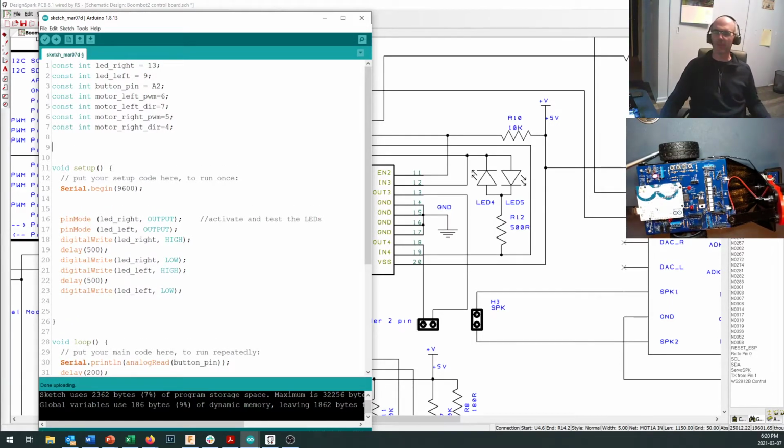Okay, so PWM, as you'll recall, is pulse width modulation, and pulse width modulation is what we use to lighten and dim LEDs, and it lets us turn the pin on for a fraction of a duty cycle. So instead of it being on 100% of the time, we can use our pulse width modulated pins to be on 50% of the time or 25% of the time. And what that means is that our motor can be on 50 or 25% of the time, and it'll do it so fast that it'll look like the motor's running continuously, just like the LEDs look like they're on continuously, but really it'll just be running at half speed. It's a way of very efficiently controlling the voltage going to the motor, the average voltage, because if you're on half the time and off half the time, your average voltage is half of your motor battery voltage.